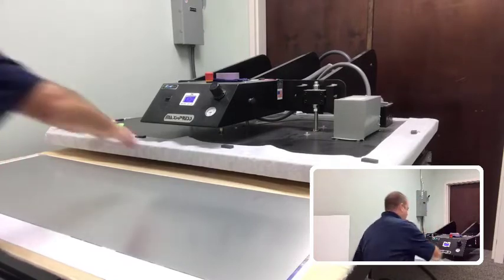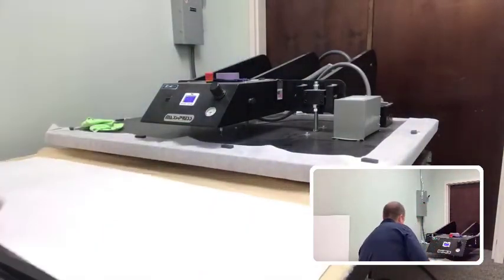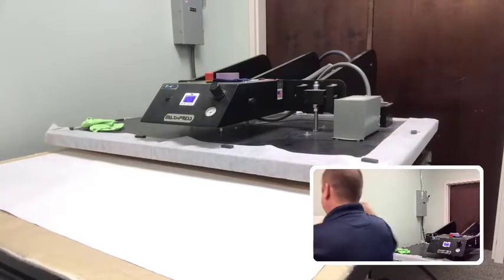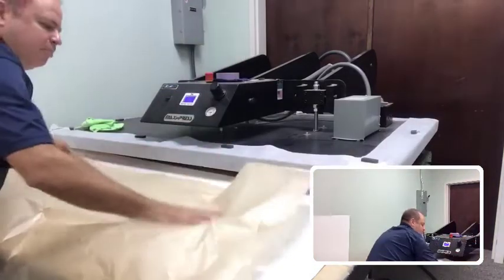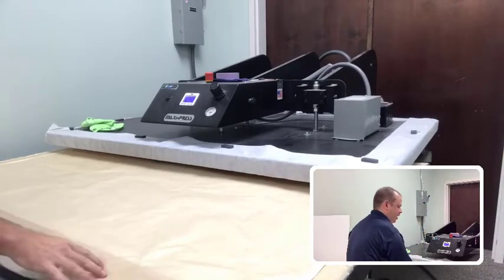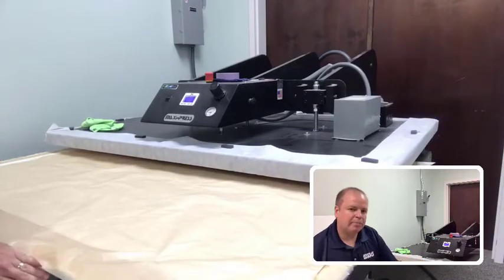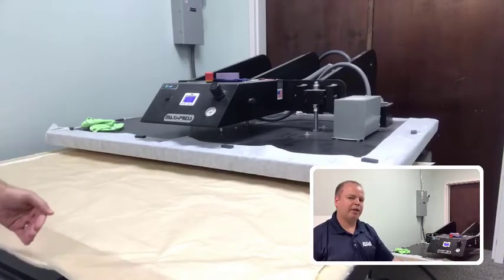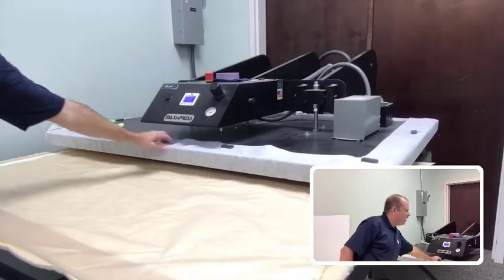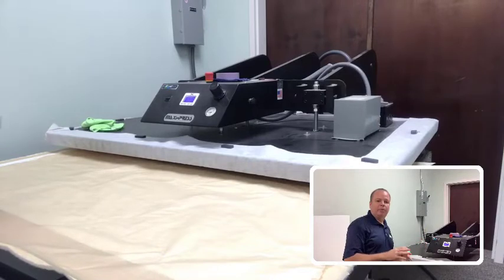The next thing we're going to do is flip this over. We always want to press through the paper because the heat from the press is on top. Then we're going to take another piece of either tissue or craft paper and place it on top. The craft paper on the bottom helps protect the Nomex pad on the press. As far as the layers when you're pressing: we've got a Nomex pad on the bottom, tissue paper to protect from ink bleeding onto the Nomex pad, then our photo panel, our dye sub transfer print, another piece of tissue paper, and then one last piece we call the magic carpet. It's an enduring moisture-wicking fabric that helps disperse moisture, which is basically the number one enemy of the dye sublimation process.